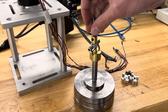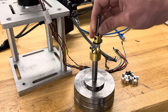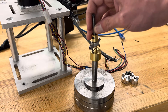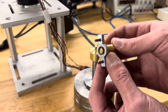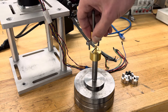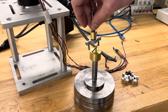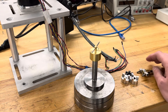What's cool about this is the motor cannot exert any forces on this bearing apart from pure torque about the axis. If we're misaligned in tilt, that's not really going to do anything as it spins. If we're misaligned in X or Y, we have good tolerance there too. These are hardened rods so they slide against each other really smoothly. If it were fixed rigidly and off-center, one dog would hit first and apply a moment, trying to bend the bearing over. But here, when it can float, if one dog hits first it just tilts with almost no resistance until the second dog contacts, and then you have a coupled moment and can drive it.